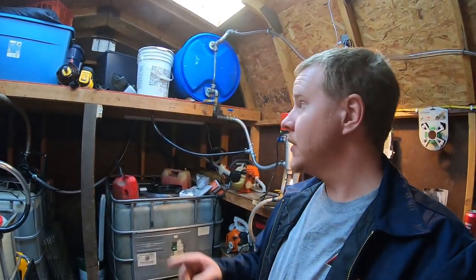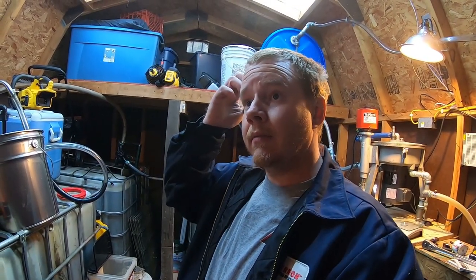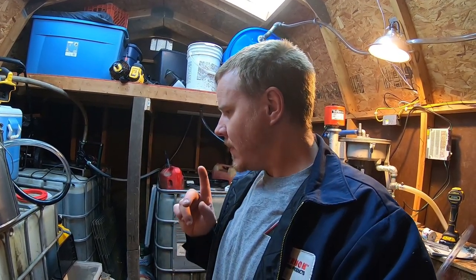I'm not going to bore you with the setup - I don't want this video to be dragged out like the first one. I'm going to fill the bucket up with oil from outside, run that directly through the centrifuge without doing anything to it, get some weights before and after, and then run another five gallon batch through the one micron filter to see the difference. I just want to verify our first results from Part 1 because some stuff wasn't adding up.